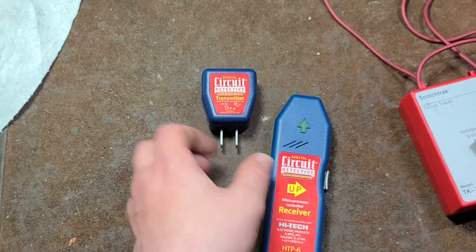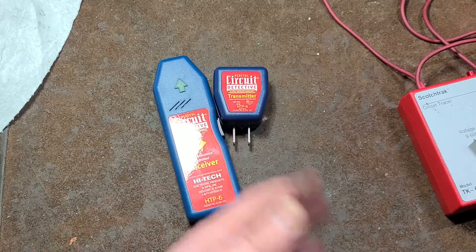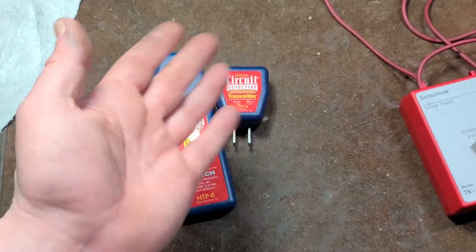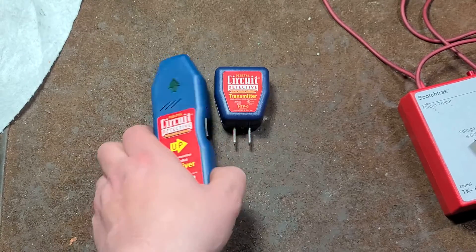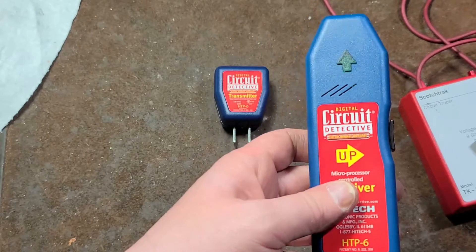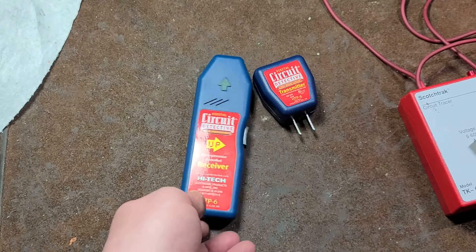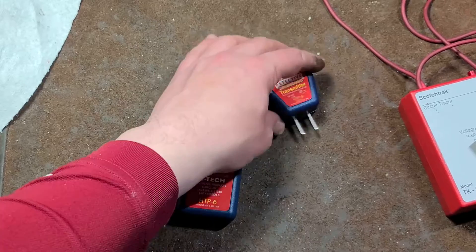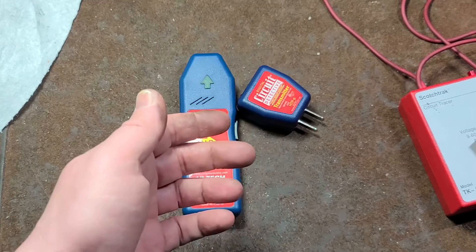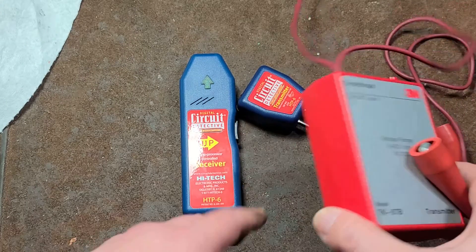This is just a little bit more elegant than the Centech cable tracer. The cable tracer — I can't find where I put it — can detect wires in walls and you can follow along them. This device is really just designed to identify what circuit breaker is associated with a given outlet. You can also use an outlet-to-light-bulb converter to identify what circuit breaker is associated with a light socket.